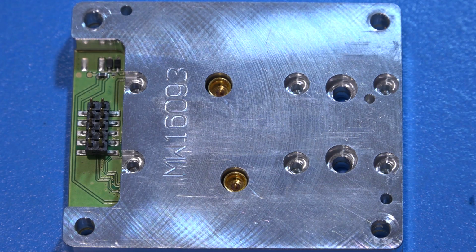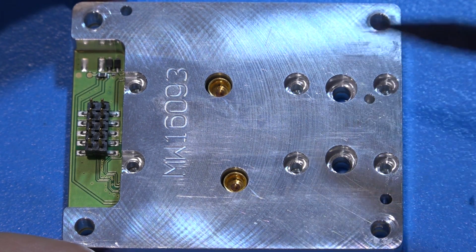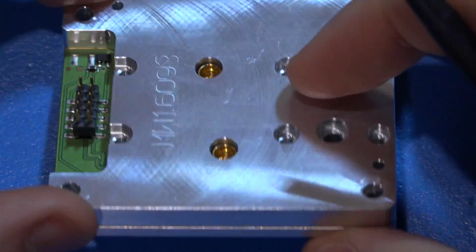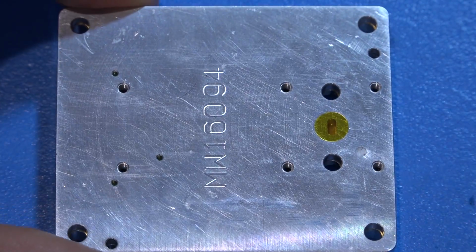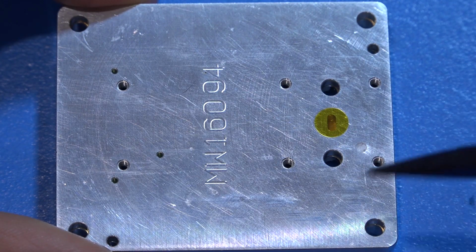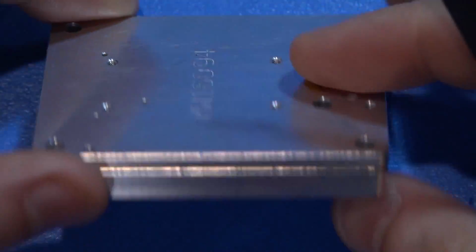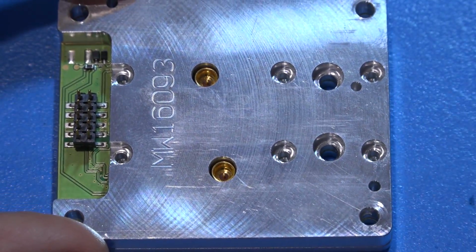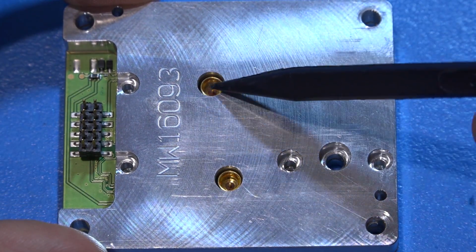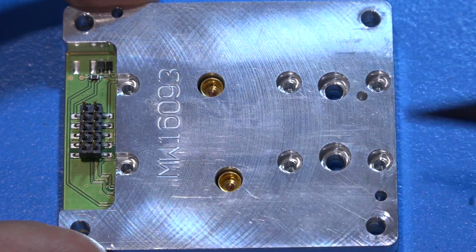And here is the RF module, and it's really quite nice. It's completely custom made, of course, for this instrument, and we can see the back of it here. So if I look at the front, where the instrument input is, it's exactly the same waveguide input, and the screw headers and mounters that allow you to connect antennas are directly mounted onto this. And on this side, we have the interfaces. There's really nothing that interfaces aside from two coaxial inputs and one header. So everything has to go through here, power, configuration, everything.